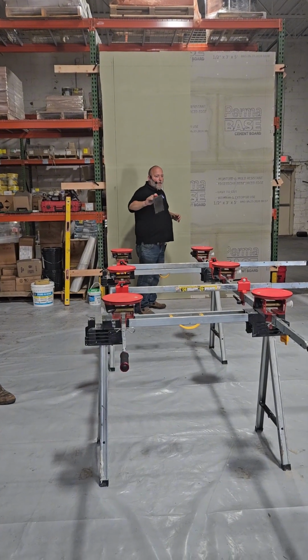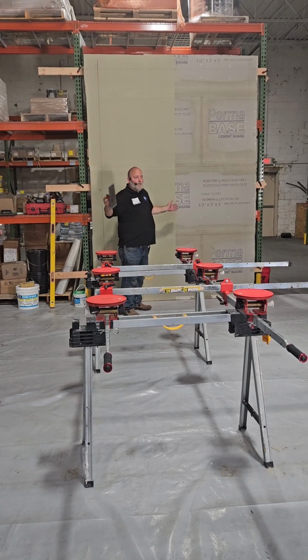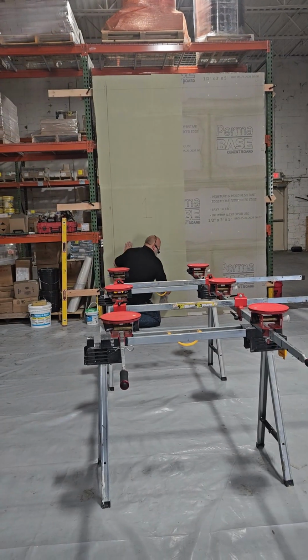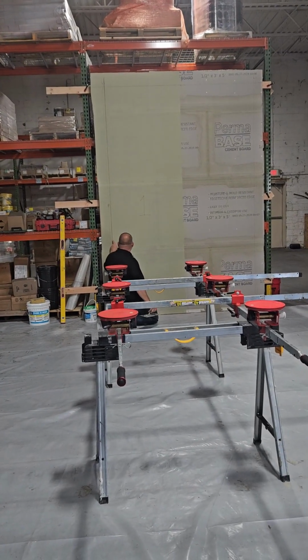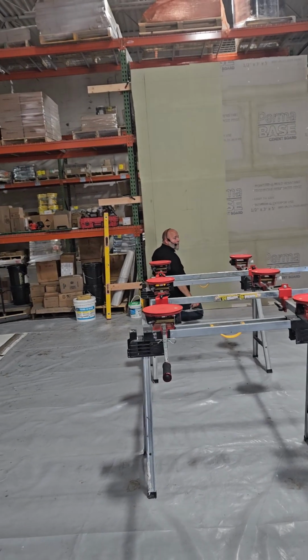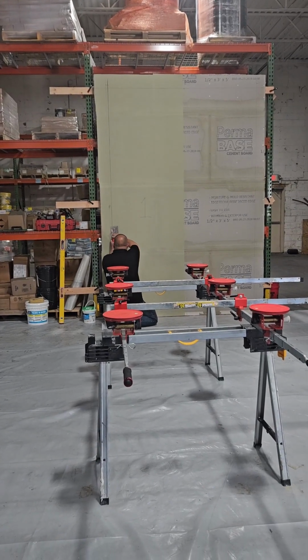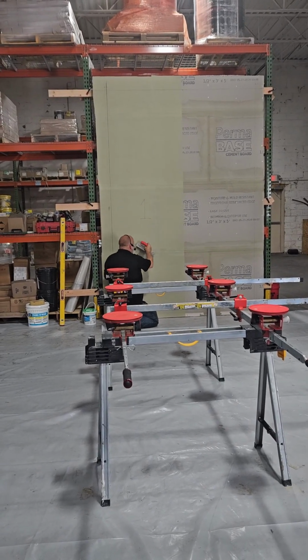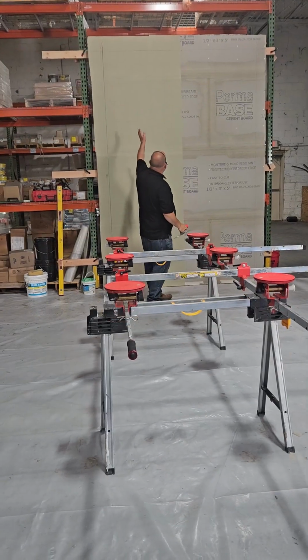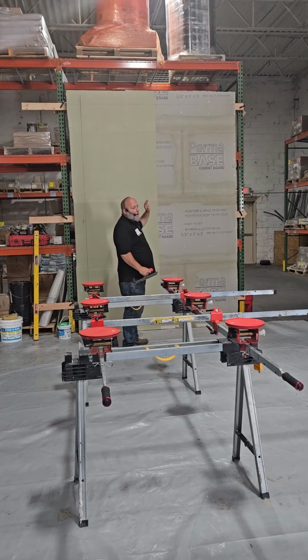Okay, we don't want to spread this panel and then have mortar just sitting on the panel for an excessive amount of time. Remember, we've got lines to lay to and we've got lines to spread to. ANSI says we need to overspread 1 inch in every direction. So we're going to key in using the flat side of our trowel. Ultimately, I want a perfect spread job. Nice full ridges, nice empty valleys.